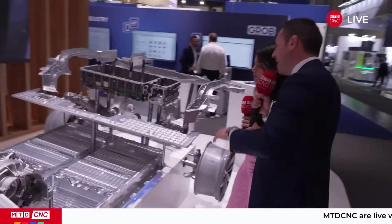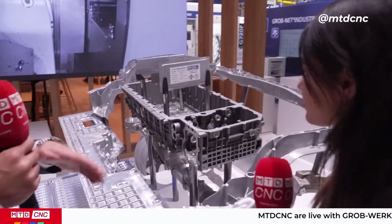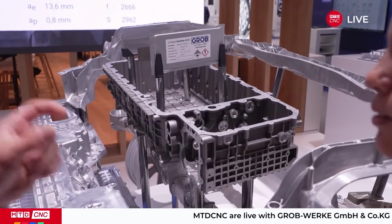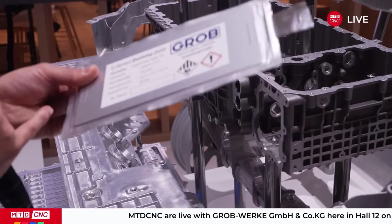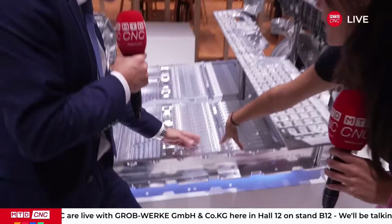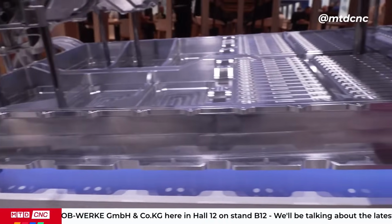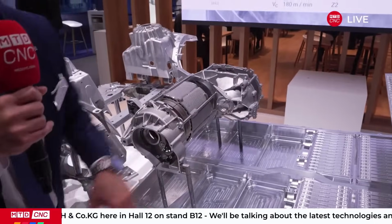What we do further is all the sheet metal machining. We're coming to this machine later, but we are also very well known for producing battery cells. So it's an anode and a cathode. There's an isolation sheet in between. We're folding all of this, a bunch of them getting glued together for this kind of cell. As you can see, it's a very thin one. You have two sides where you can get the current in and out in the end, and a couple of those become a pack. Those packs will then be racked here in the big portion, and the whole frame in the end is below your car, and that is actually the whole battery that gives the energy to the engine to push the car further.